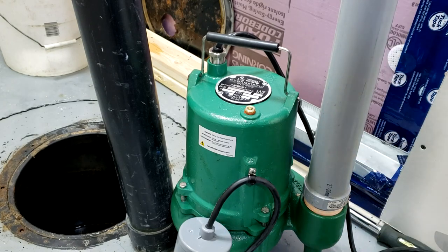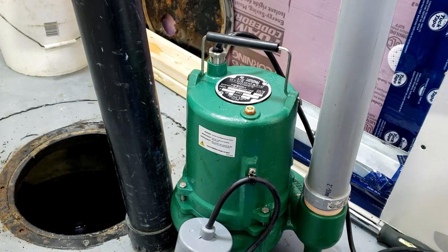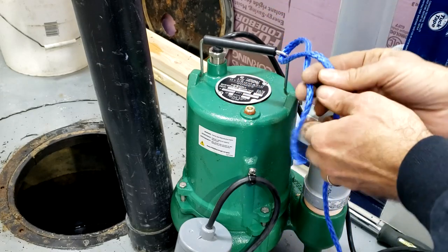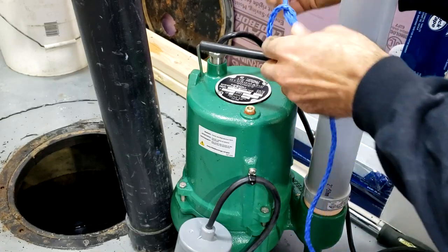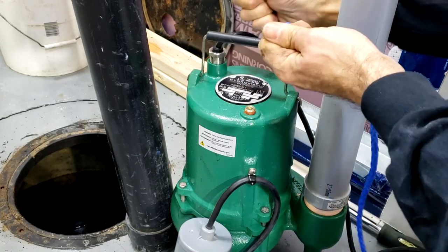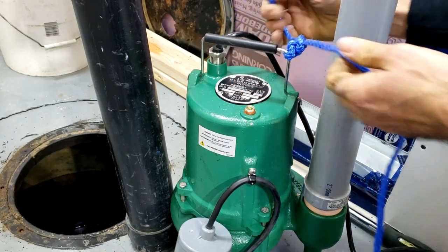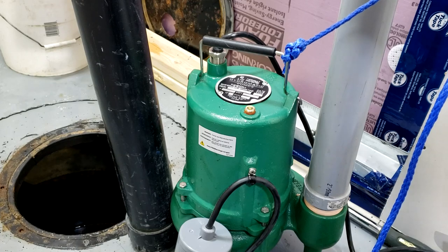In this case we don't need a bleeder hole because this is a good pump. Another thing I'd like to do as a measure of good workmanship — although we're already given a heavy-duty handle for servicing and transporting the pump — I like to add a piece of rope. Something that's not going to corrode and wear out over time as it sits in there. I'd like to provide a bit of slack and leave it suspended just below the lid. This will make it much easier and less messy to remove the pump in case you need to do so in the future.